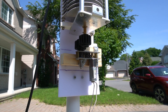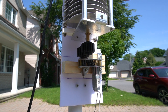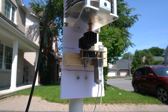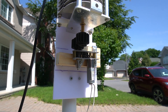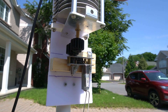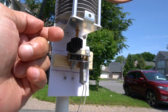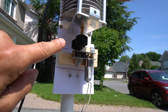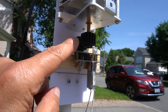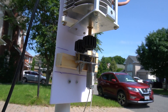As you saw, it was pretty basic building — the materials I used can all be improved later, but just to see if it worked or not. My first attempt did not work because the gears were too small — when I put it on the PVC mast they would slip. So I figured I needed a bigger gear with bigger teeth to grab each other. Now it's working just fine with the bigger gears. So it's pretty basic remote tuning.